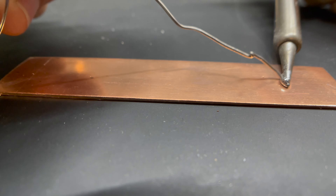Let's take a look at what you need to do if you want to connect a wire to a PCB board pad. First you need to tin the pad — you might want to use a larger iron tip for this, like a flat tip. Tin the entire surface of the pad, bring in a tinned wire, and make sure you're able to heat up both the pad and the wire and get the solder to wet both of those things. You want to bring in enough solder that you do not see the individual strands of the wire. Add a little bit more solder, and ideally at the end it's going to come out looking something like this.